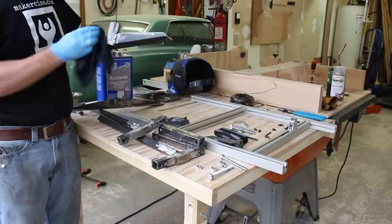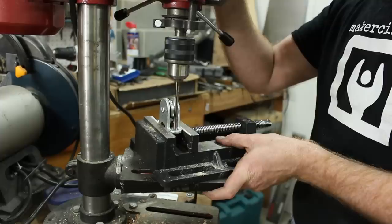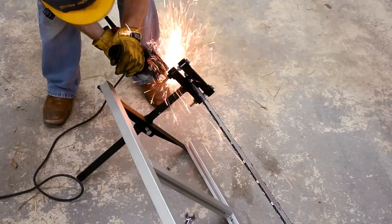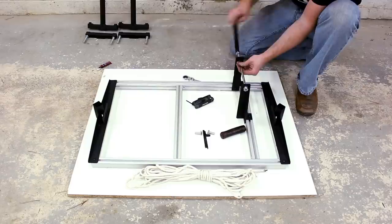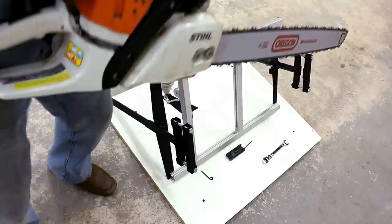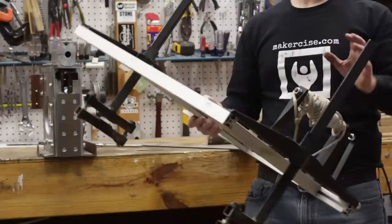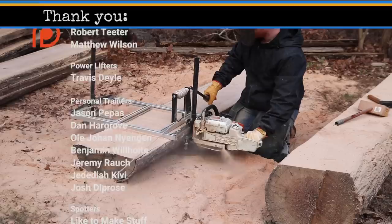I used some acetone to clean up the parts, then hung them from a rack and gave them a coat of black spray paint. I drilled out the holes on my pulley to accommodate the 8020 hardware, and I trimmed the clamp bolts to length once the chainsaw mill was assembled. There are a lot of off-the-shelf chainsaw mill options, and I'll put links to some of the most popular ones in the description. But if you really enjoy exercising your inner maker, you'll want to build your own chainsaw mill. If you're interested in plans for this chainsaw mill, I'll have a link in the description — it has the full parts list and dimensions I used, plus specific recommendations based on my actual experience using this mill. In a future episode, I'll demonstrate the use of this mill. In the meantime, check out one of my previous chainsaw milling episodes.